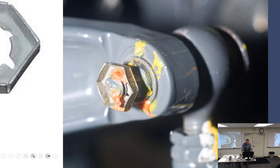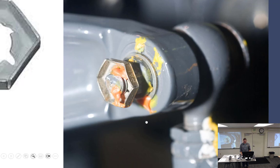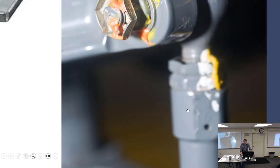This is an interesting thing to look at. I've never looked at it in this light before. This is called a heim joint. There's a ball bearing in there, and I think I have a picture coming up. Cessna does have an airworthiness directive that a large washer goes on the opposite side in case that bearing breaks. This housing won't slide over the bolt head. This right here is what kind of nut? A reduced diameter nut that is self-locking, with a palnut on top, with dope. I promise I torqued it. Yes, with torque.